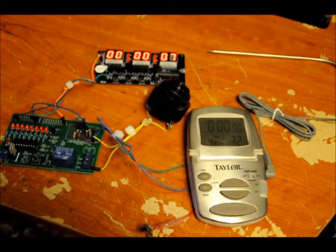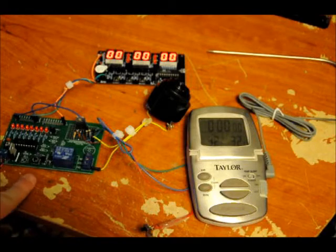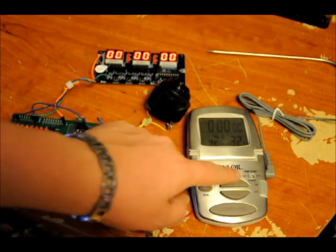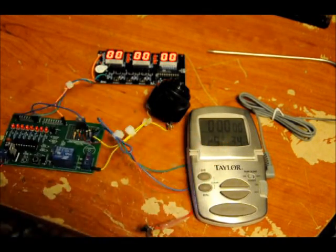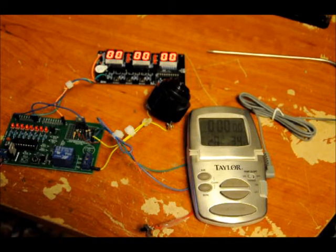And there you have it. Now the clock alarm is also going to go off — that's the little onboard buzzer, and it only goes on for about three seconds. Because we haven't set it again after power-on, we have to press the button after we power it on. The main alarm did not go off because it was not in set mode. So again, it's essentially an AND function. Once you have the thermometer set and the clock set, you activate everything and press the main program button on the main interface board, and it starts looking for either one of those signals.